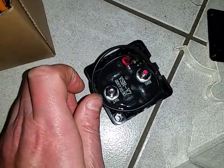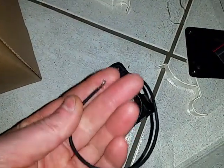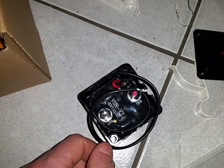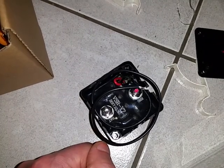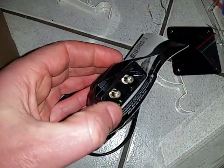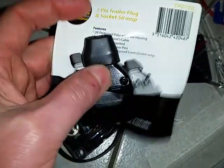And of course, because this is a relay, you can't just have a positive in and a positive out. You need to have a positive and a negative to even run the relay itself, and that's your negative lead there. That's got to go on just to run the relay. Aside from that, your starting battery and your house, coach, deep cycle battery, your second battery, both share the same negative. At that point, that's when I wire this into the negative that's going to be coming through on this plug that the auto electrician gave me, which is the opposite side to the one that he fitted just behind the front passenger seat there, and I sure as hell am not going to fit anything out of that.